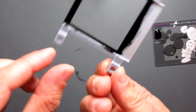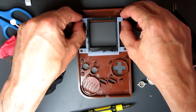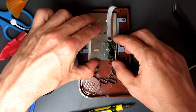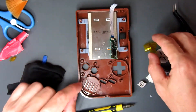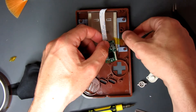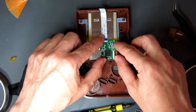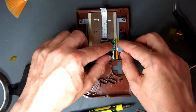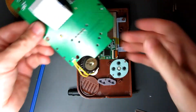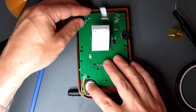It's a very handy little item and takes less than 20 minutes to print. Here's how this works: the bracket sits in here and just goes around these four pegs, then the screen just sits in the gap there. I'm going to put a little bit of tape on — it doesn't particularly need securing in place because once it's all closed up this bracket will hold it in place fine. Just move that over to there, stop with a little bit of double-sided tape. That's pretty much everything in place now. I can just get my speaker lined up and drop my main board on there, just making sure that ribbon is exposed so it can reconnect.